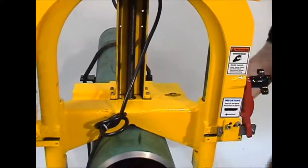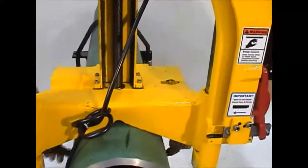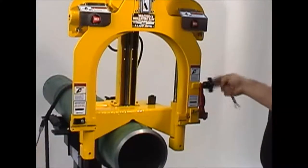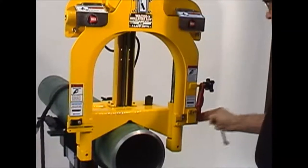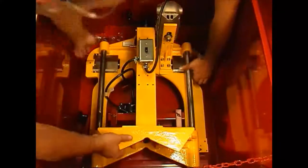Model C Guillotine Saw. Providing you have the correct saw model for the pipe to be cut, there is no reason to measure the pipe. The clamp chain provided covers the full range of operation. Before proceeding to install the guillotine pipe saw, make sure that the blade is raised as high as possible by turning the feed handle counterclockwise until it tops out. Lift the saw onto the pipe.